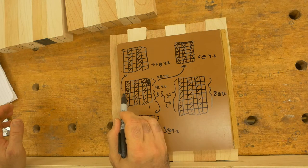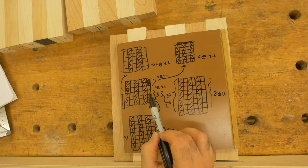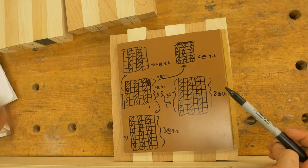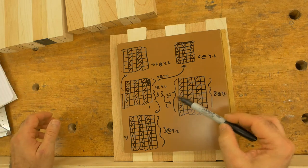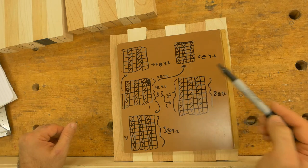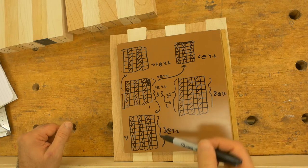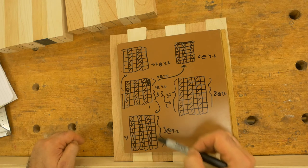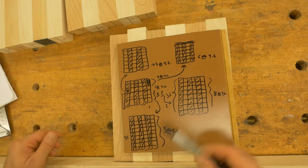These are now fully 5x8, and I can simply swap the patterns to get the checkerboard. That's going to leave me with possibly three pieces of cherry-to-maple pattern, which I'm going to use for my 6x10 boards. I find similar length boards that give me something that's missing. One board that is 37 centimeters long is going to give me eight strips, so I need to take two from here to add to the sequence to get 6x10. Then I have boards that are 41 centimeters that will give me nine strips, and the remainder added there gives me the full 6x10 board. Then I can again swap patterns.